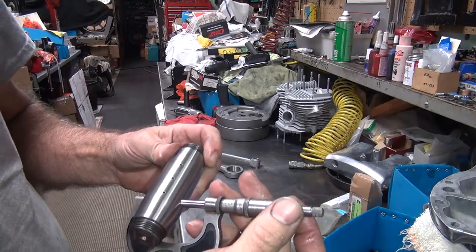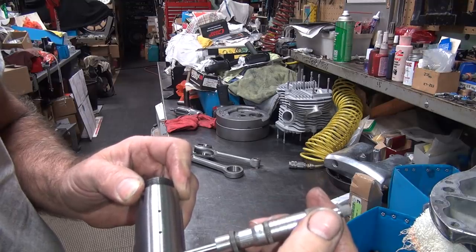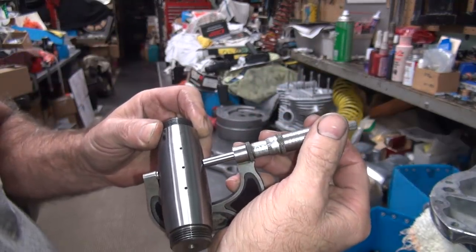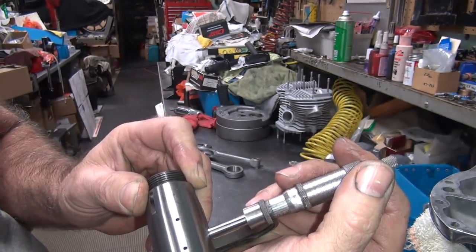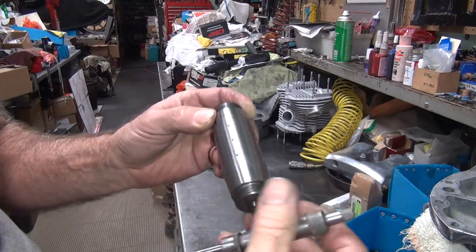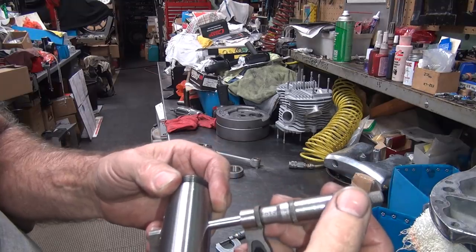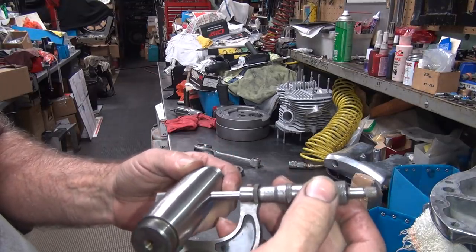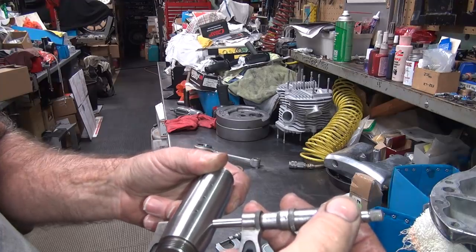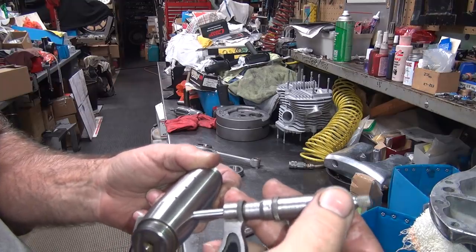Okay, let's go ahead and measure this, see what diameter we got. Appears to be undersized a little bit. Looks like we're about 5. If you look at the little small lines, the 5 line lines up on the vernier scale. That one not, it's about 3. That's unusual, it's got taper in it. Usually this stuff is within 1/10. This thing is not within 1/10. And that is way the hell different there. This pin's no good. This is a junk pin.